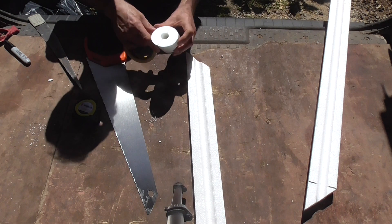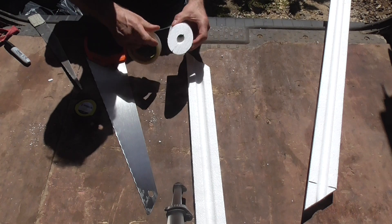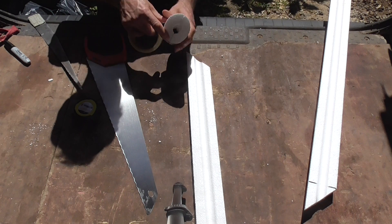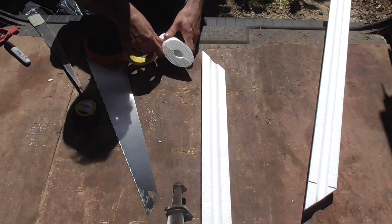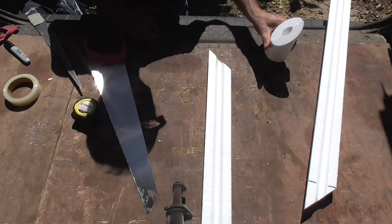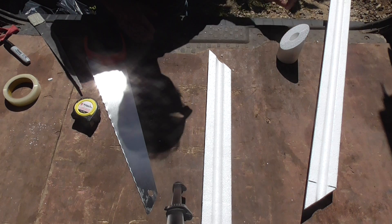And again, if it was a radius fitting, just put them together and scoop a piece out. And if it is a knuckle fitting, you just scoop out as I showed you before. And that's all you need to do so it fits beautifully on the pipe. So that's the start of our riser fitting.